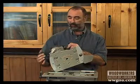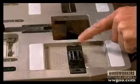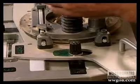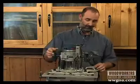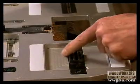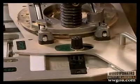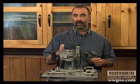So here's how the whole thing works. When I want to cut the mortise, the pin will follow just the straight track in those guides, allowing the router to move left and right. Then I change my boards and allow the pin to go around the outside of the guide like this, and that's going to take away everything but the tenon on the ends of my rails.